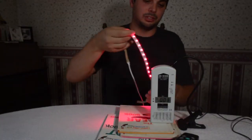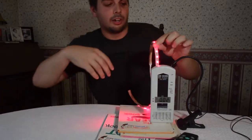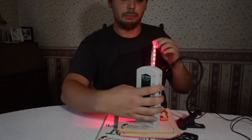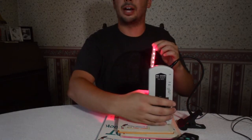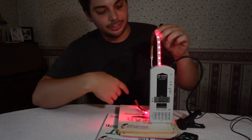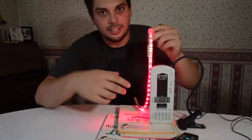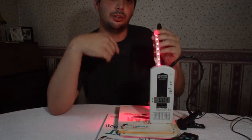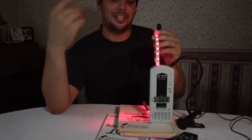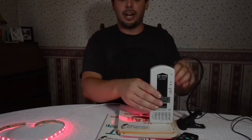Same thing for the Rave — I'll dangle both lights right next to the meter and you'll still see nothing going on. Switching to magnetic field, I don't even expect a high reading because the amount of power and current running through these lights is negligible. We're reading about 10 in nano Tesla, which you divide by 100 to get milligauss — so that's 0.1 milligauss. That's practically nothing. Really great lights to use around the house plugged into a computer or battery pack with no EMF issues.